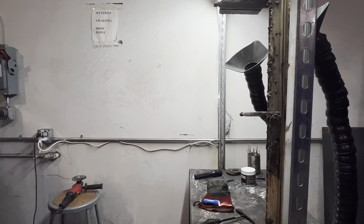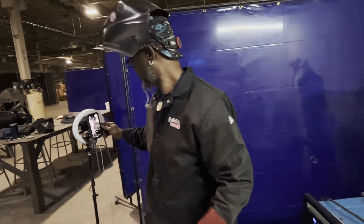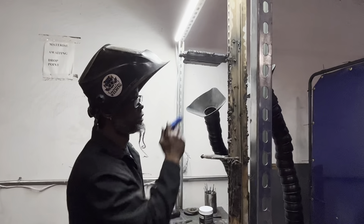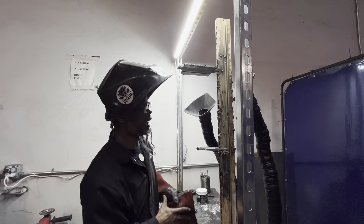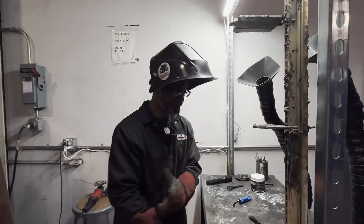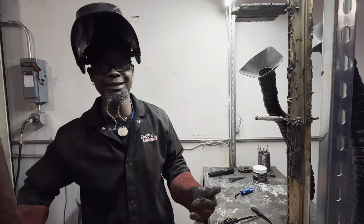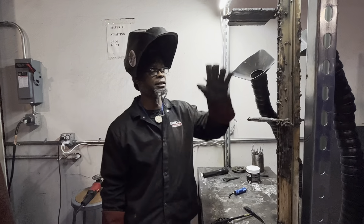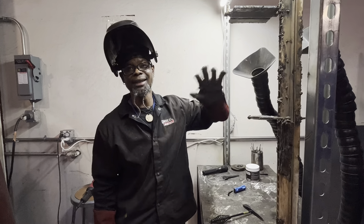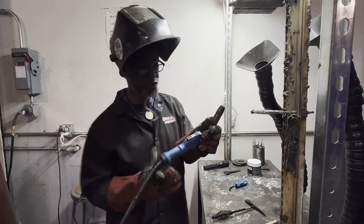We're trying to kill seven birds with one stone here. I'm at the stage now where I should have two passes — two stringer caps to knock this out. This process isn't bad, especially when you're using the three-eighths plate. This is a three-eighths scrap coupon plate. Three-eighths is not a whole lot; it's easy to fill up. It doesn't take a whole lot with this three-eighths using this flux core. Now we're going to run our first cap.